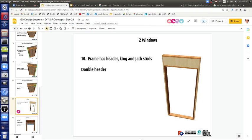I'm sorry to say this again, was it ever discussed to put more boards in there to fit a more common type of door? Or is 39 a common door that I'm just not aware of? 38.25 is pretty common, and to do that, we are going to put in more spacers, which is going to be a one by spacer to get that from 39 to 38 and a quarter.